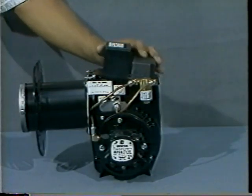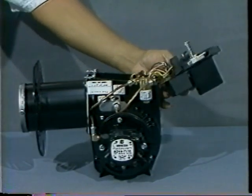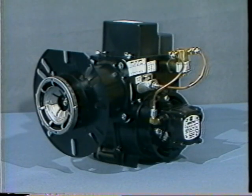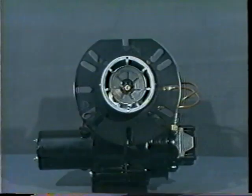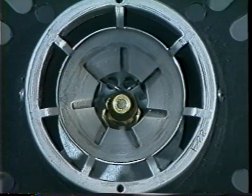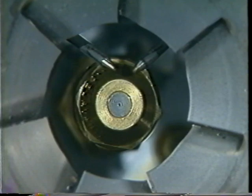First, some important maintenance information on the 12-volt burner blower unit. The unit is made up of several components that are designed to deliver safe operation of the melter. Fuel nozzles need to be checked and cleaned regularly to ensure proper flow. The gap for the fuel igniter should be calibrated for proper spark and ignition of the diesel fuel.